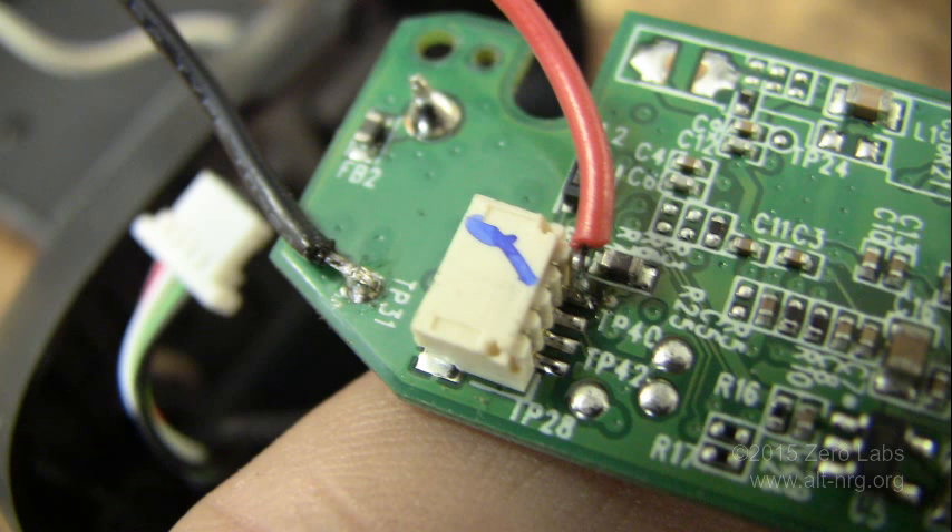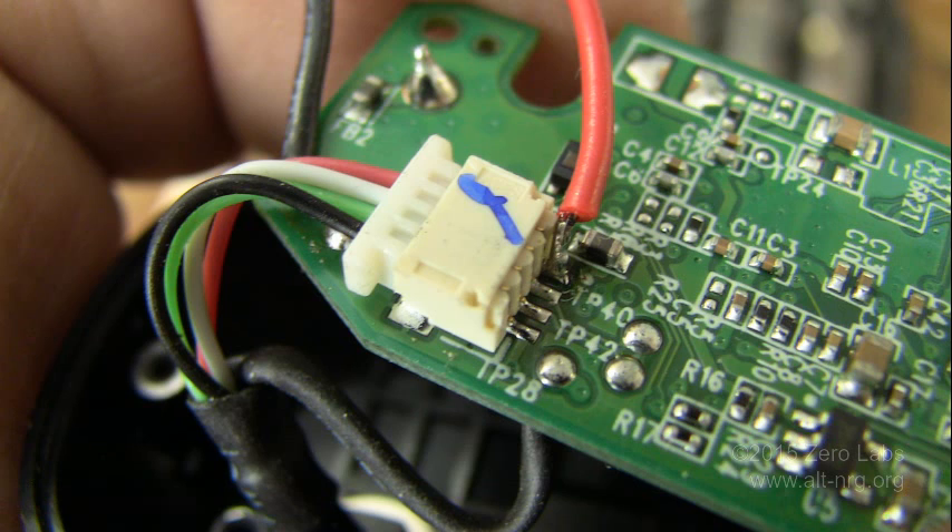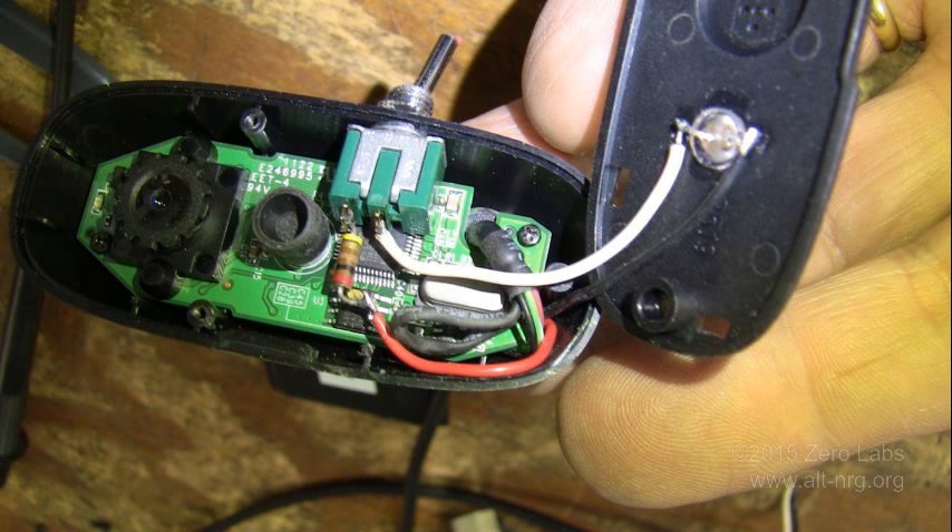Power is taken off the 5-volt USB at the internal connector. These wires look deceptively large, but they're really quite thin. Here's the connector with the factory wire harness reassembled, and now reassembled into the camera housing. A quarter inch hole is drilled at the top of the housing so that the edge just reaches the first lip at the rim of the plastic housing. Spacing is very tight. The LED just barely clears the empty pin location of the single-pole single-throw ALCO switch. I also had to bend the lead with the white wire 90 degrees counterclockwise just to clear the switch.